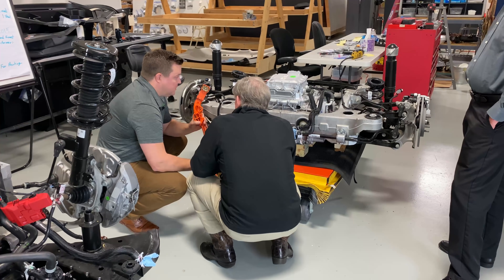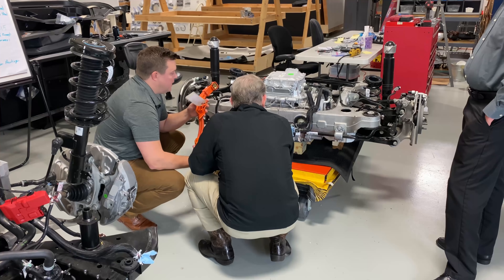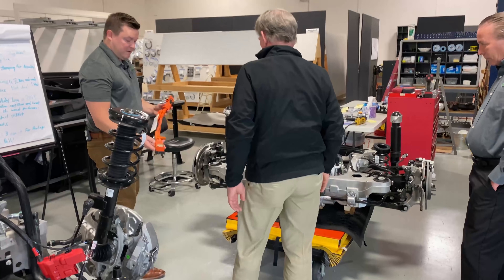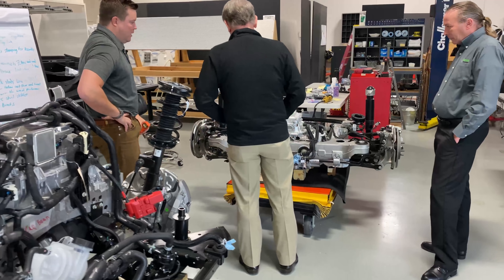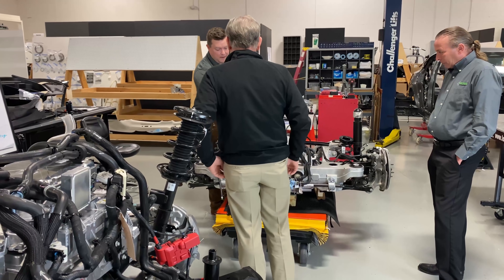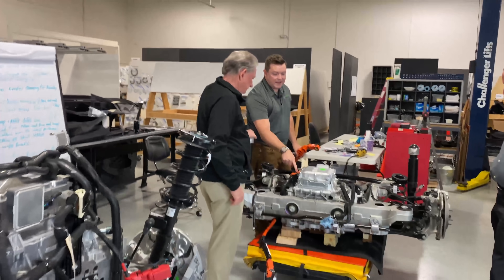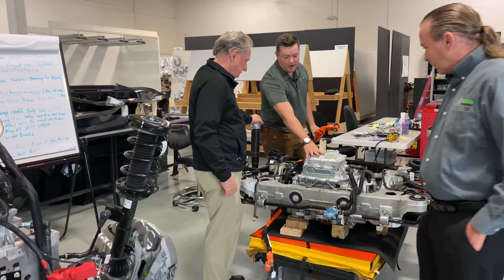But what is paramount in EVs? Every gram, every ounce, every centimeter. The Tesla connector is 67 centimeters. The Ford connector is 100 centimeters. How long was Ford working on this design before they decided they must have their high-voltage connection back here? When did they decide that this was ideal, or were they given this based on a common off-the-shelf component? The inverter is partially integrated into the EDU — but you can still see it's a separate box.